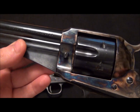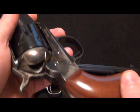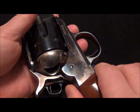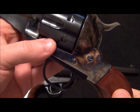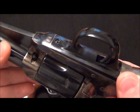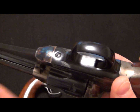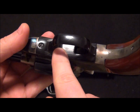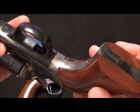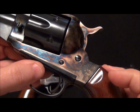The other thing I like about the Remington models versus the Colts is that taking it apart is extremely easy. On the Colts you have the back strap and everything is under pressure from the spring. With the Remingtons, just like the black powder versions, there's a screw here. You take that out and you can literally pull and lift out the trigger guard assembly, which opens up all of the internals. Then you unscrew the grips, take the grips off, and you basically have it taken down. A couple more screws and all the internal parts come out.